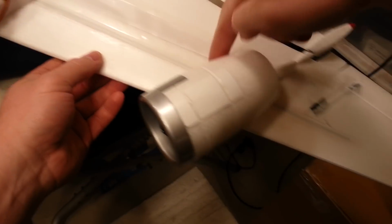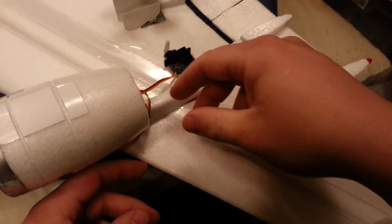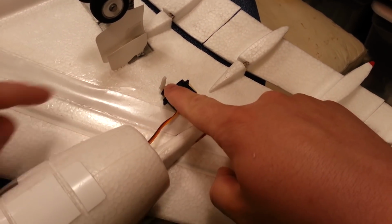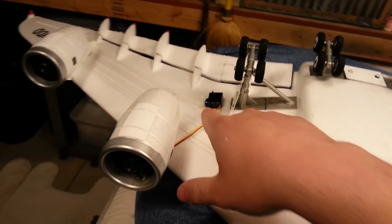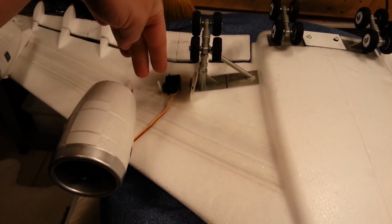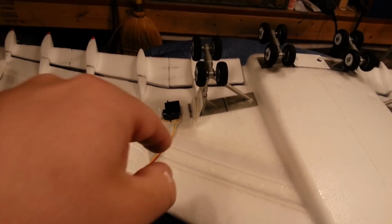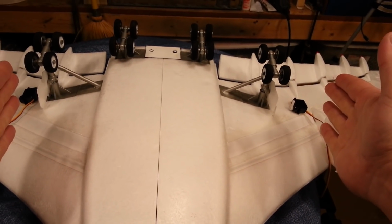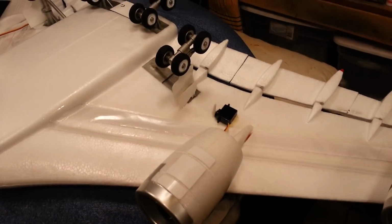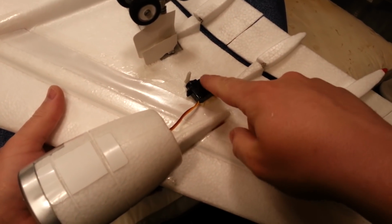Here is a wood strip I've taped over it, but this balsa wood strip is supposed to stiffen the wing. Of course, it's completely ineffectual, probably because I didn't glue it enough. But the idea is the location I've got for where this control arm is compared to where this control arm is, it's very, very close positionally between here and here, and then triangulated so that we're kind of in the same spot so we can pick up that same point on the control surface, because we really don't care what direction the servo is facing beyond the fact of symmetry on the wing and the overall look of the wing. But we're going to cover this up. It's going to be either painted white, or covered with a small piece of paper or plastic or something like that.